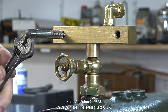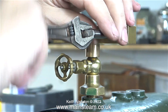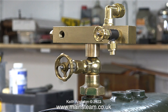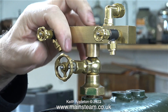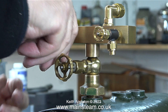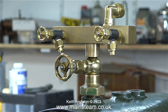Initially when I threaded these two holes at the front of the turret I used a taper tap. Now I'm using a plug tap to go further in. Here I'm threading the other side — now both of these are 3/8 by 32 threads per inch. Once the tapping operation was completed I blew away all the swarf using an airline. Here's the injector steam valve fitted. All of the other holes on this turret are threaded 1/8th BSP, which is quite similar to 3/8 by 32 threads per inch except 1/8th BSP has only 28 threads per inch. I will be fitting copper washers to these valves to make sure they're in the right position. When I fit them for real I'll be using Loctite 542 thread sealant and shim washers to make sure they're in the correct position when tightened.